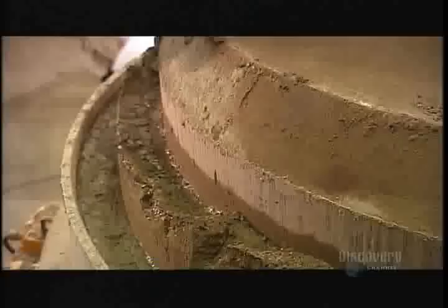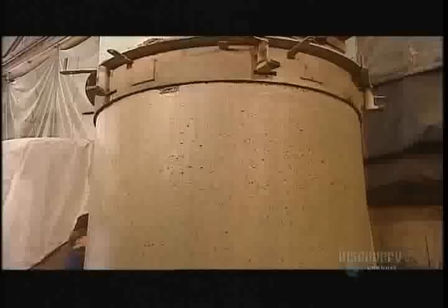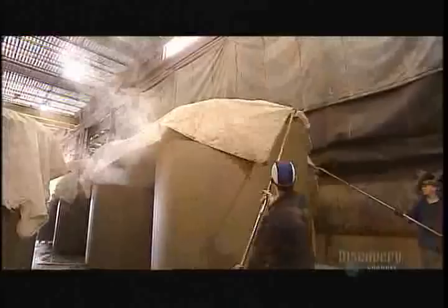With either pipe forming technique, the molded concrete is quite fragile, so the molds go off to the curing warehouse to harden. There, workers remove the molds, leaving the pipe standing upright. Steam hoses transform the curing warehouse into a sauna — the temperature rises to 60 degrees Celsius and the relative humidity to 100%. The concrete hardens in about 12 hours.